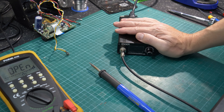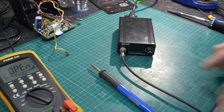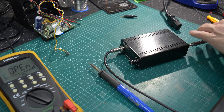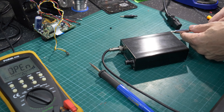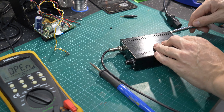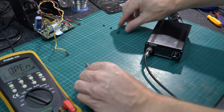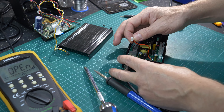Don't put the top cover on until you've connected the power supply back to the logic board. Trap for young players - let's quickly undo that again and plug it back in. I won't edit this out - you were probably screaming at the screen earlier saying plug it back into the logic board. There's our culprit - it's never going to work with that out. Let's pop that back in.